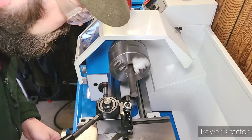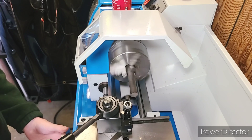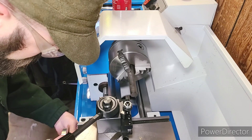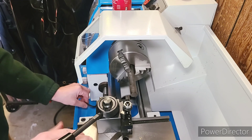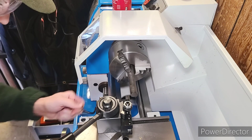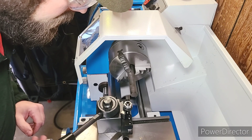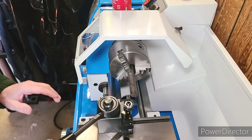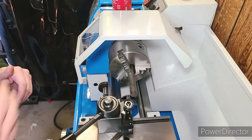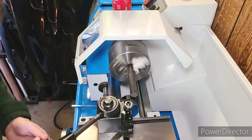I move over so we touch off right there, then back off and reset my dials. We also want to lock this carriage. Now I'm going to unlock my carriage and move it over just a thousandth of an inch — really simple right now — then lock it again and slowly start feeding this in and start taking a cut. Again, I'm not an experienced machinist. I know I can probably take more than a thousandth, but let's just see what happens.